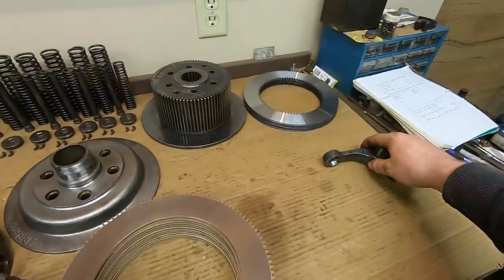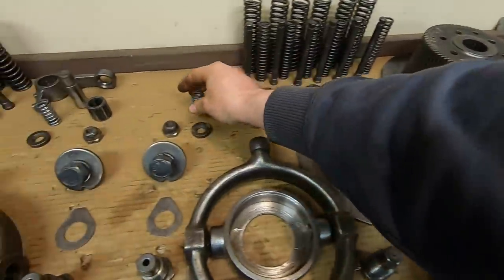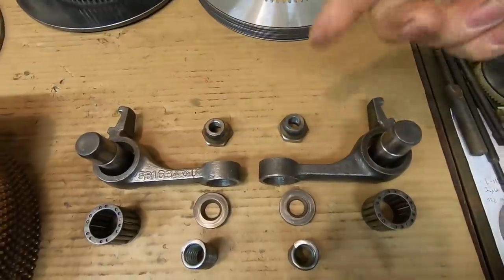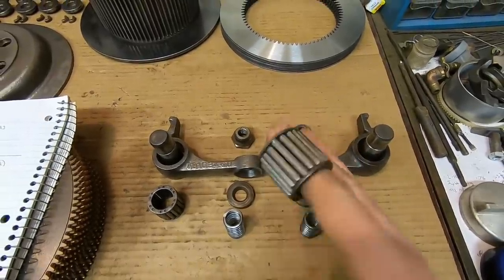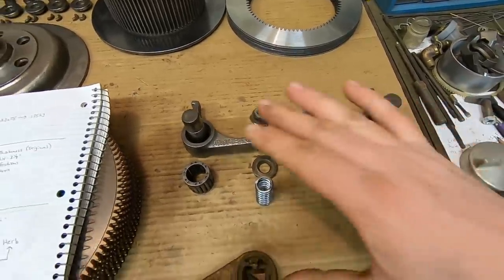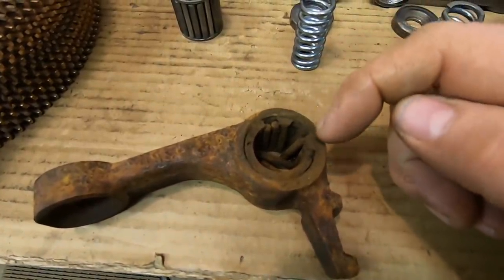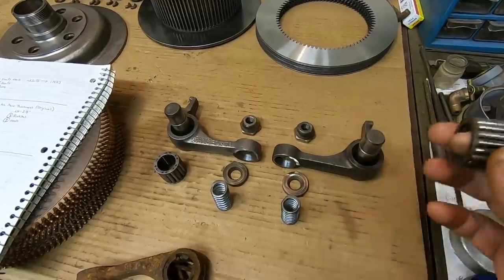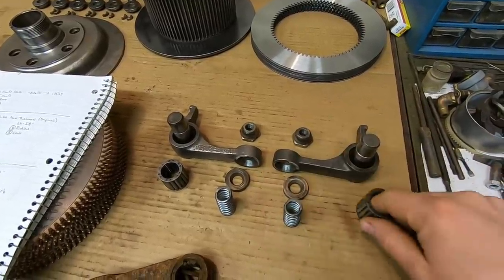Let's clear some more pieces from the bench. We can do some corner pieces. We have the actuator lever for the steering clutch, the bearing, and the shaft — then the spring, acorn nut, and washer for the pull rod, times two. One talking point worth mentioning: the needle bearings that run inside these actuators are extinct. There are no new ones left in the parts chain, and I have not been able to source any new old stock either. So good used is what I'm down to. I have a few of these because every time I dismantle a D2 back end, I pull those shafts to see if we have good bearings to salvage.